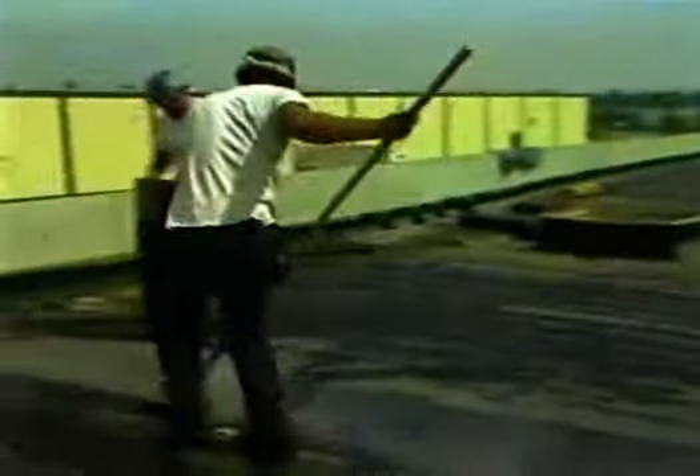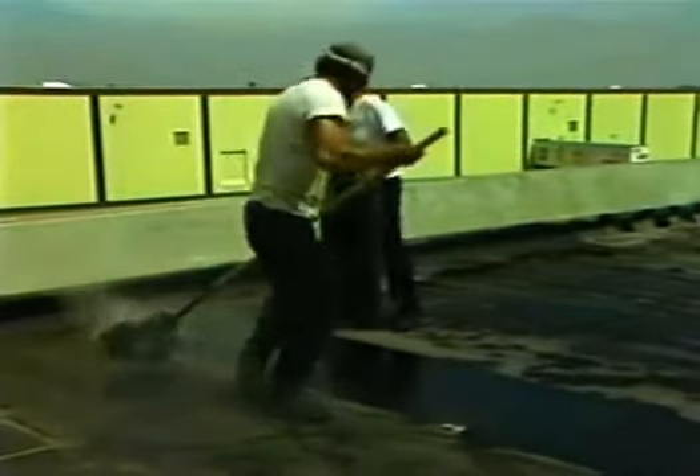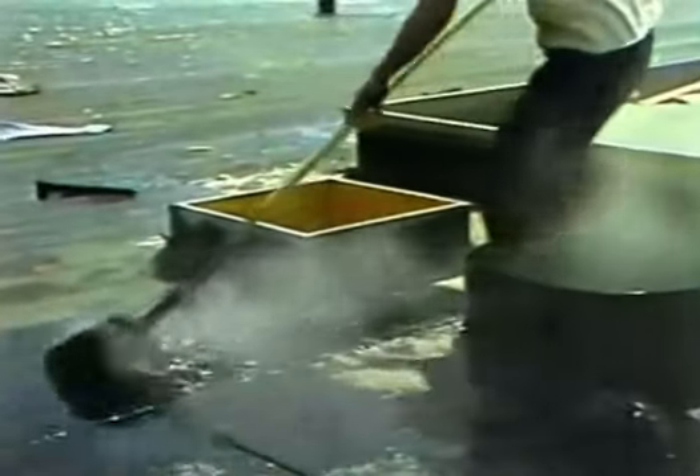Asphalt flows out of a fiberglass mop better than a cotton mop. With fiberglass, asphalt coverage is increased and improved, and an even distribution of asphalt with no voids is possible. Fiberglass mops glide across roof surfaces, while cotton mops tend to drag.